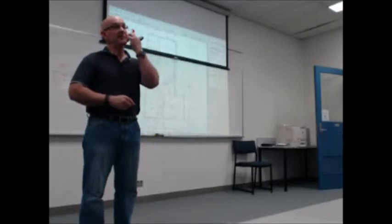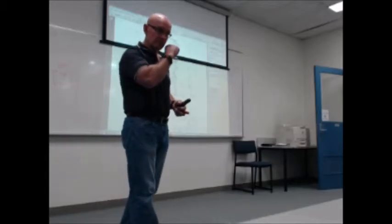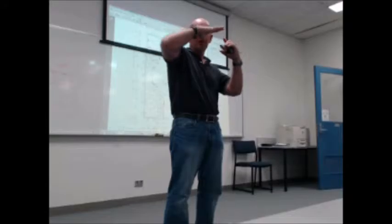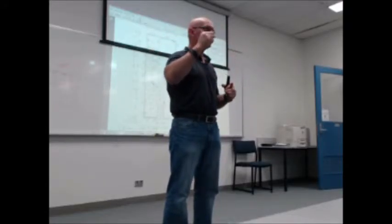Yeah. What Danny said before and all about natural deviation in tiles. I did an inspection of a house a month ago and there were 600 by 300 porcelains. And there was quite a few lipped tiles. A lipped tile means one sits slightly higher than the other. So it might be cocked like that and the next one sits flat. And the tolerance I think is about 2 mil over level or I forget exactly.